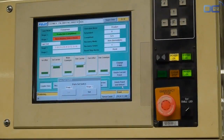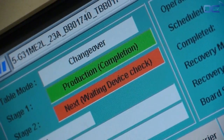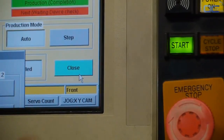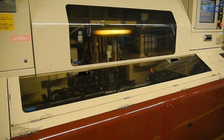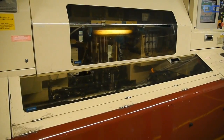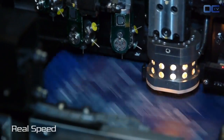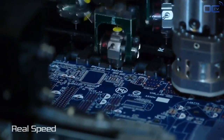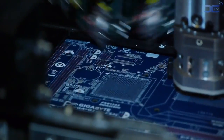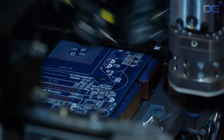All the motherboards today have really thin and small components that are directly placed on the board, called SMD, Surface Mounted Devices. The high-speed chip placer can place from 5 to 10 components per second — it's really fast. Most of the components mounted in this machine are around 1mm wide and must be very precisely disposed on the PCB.